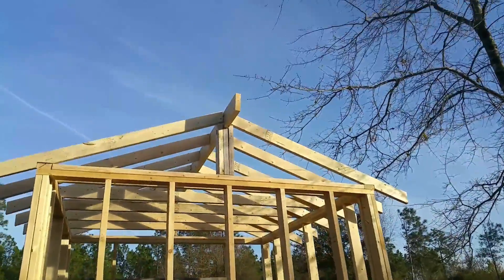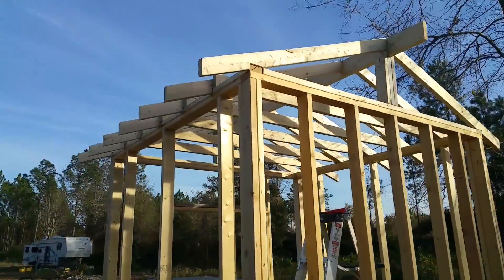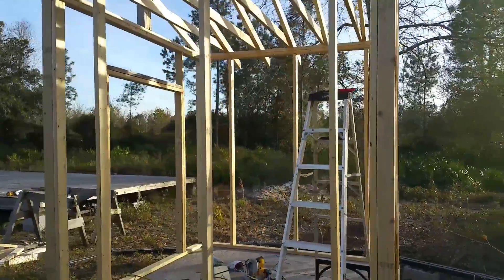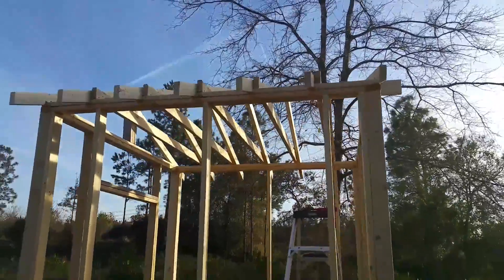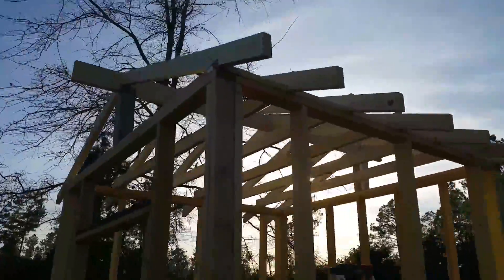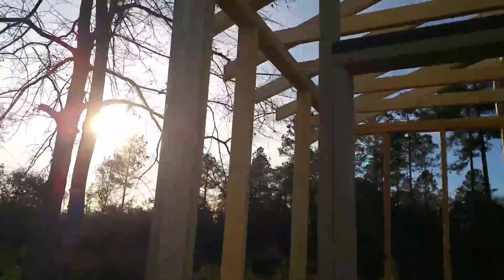The majority of the weight is going to bear down on the left and right sidewalls on the length of the building. We put the ceiling joists up in order to offset the weight from pushing the walls outward, so that'll come in handy later. That's pretty standard for any framing, and on this side we have the same thing going on.